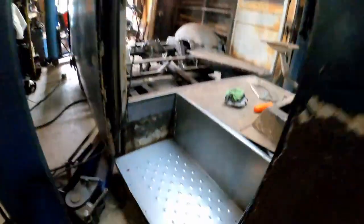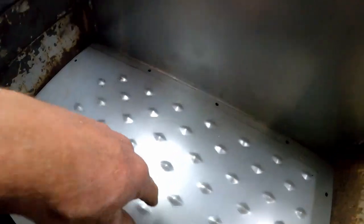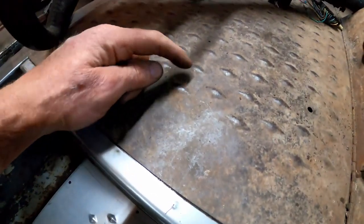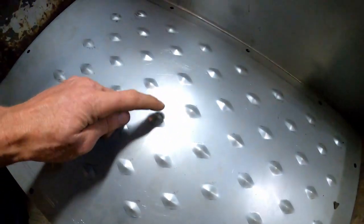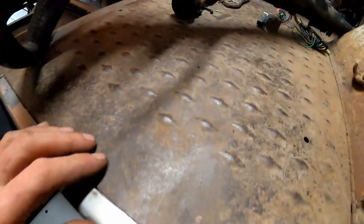Just like that, the panels are in and we can install them. All right, so did anybody catch my mistake? Yeah, I gotta eat a bit of crow here, but you see this pattern? You probably noticed when I was measuring this pattern from the old pattern that this is a lot tighter. Yeah, it's because when I measured an inch and a half across the row, and then that was it. Didn't go back and remeasure it. I just measured an inch and a half across the next row. So this is double wide than what that should be.